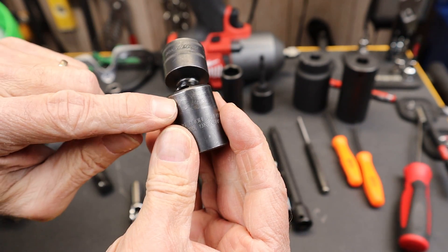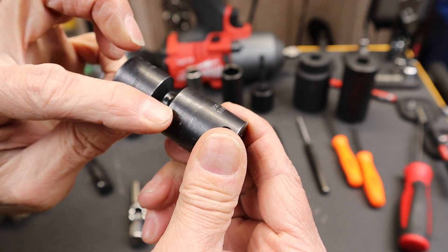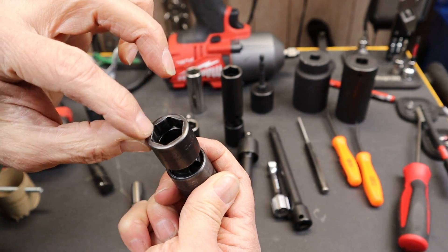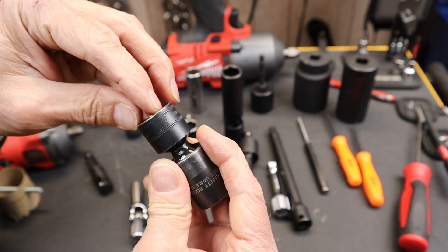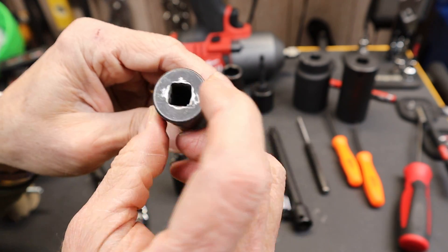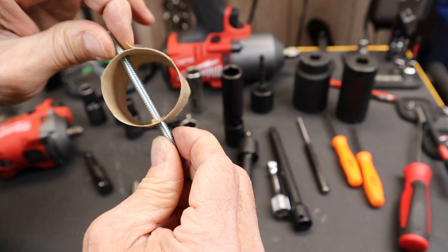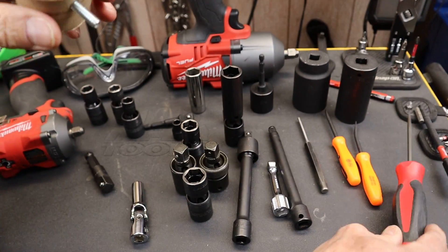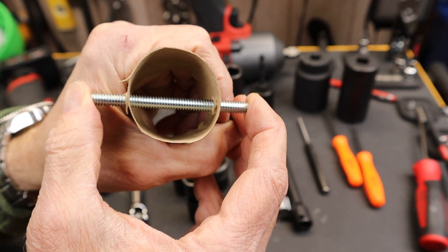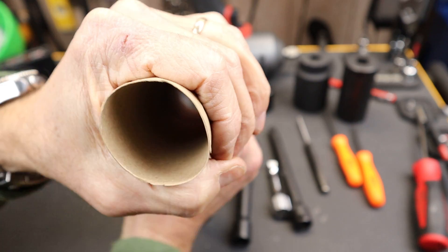With the laser-welded pin design, you can barely see that circle — it's a good design, but there's a problem. You're putting essentially 360 degrees worth of force onto a fastener, knocking on the corners which spreads out the force. However, all of that force is then transferred to where this pin contacts the walls of the tool side of the socket. I made a model to visualize this — I used a Snap-on awl to punch a hole and thread a rod through — and you can see what's happening as that force transfers.